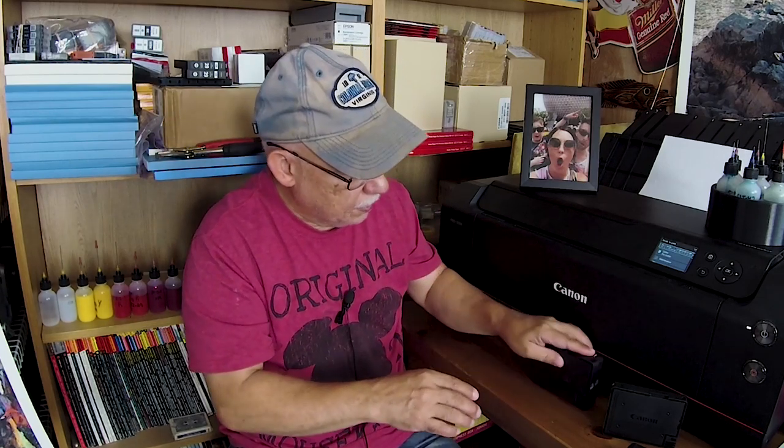This wasn't one of Canon's greatest creations. It is a killer of a printer, but it has the same maintenance requirements that the Canon Pro 1 also had. So: when low or empty, remove the cartridge, remove the chip, modify the chip compartment, put the new chip on, fill it to 84 grams total weight, and pop it back into the printer — four steps. Once this printer is done — meaning those internal pads are full — unless you're lucky and in a large populated area where a local service center may have access to replacement pads, that'll be the end of it and you'll have to upgrade to something else.